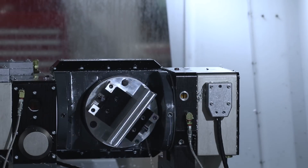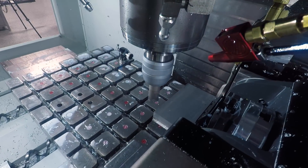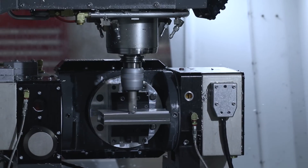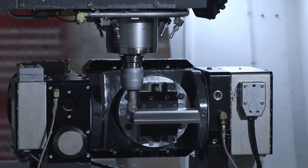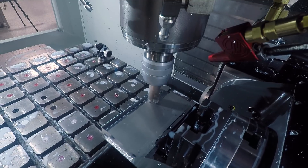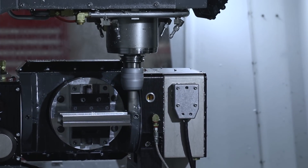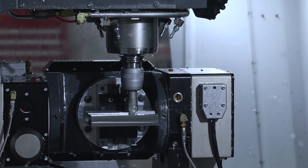I was really nervous that we would lose stability, rigidity, or have chatter — and we really just didn't. The Haas machine, the trunnion, the tool paths were far less fragile than I was worried they might be. We're also starting to use longer gauge length tools because longer gauge lengths help you avoid things like your trunnion and your vise. In some orientations it's not that bad, but later in the video where we start diving into some pockets and parting this part off, you are going to run a lot closer to potentially colliding.